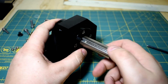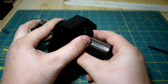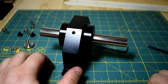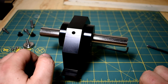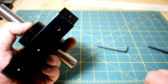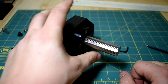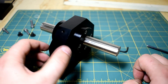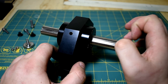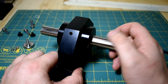I've got everything loosely put together here. I've actually got the flanges a little loose too, because I want them to find their coaxial positions together. The reason I did an oversized bore in the middle with flanges and bushings on the outside is so I can adjust it later. All of the features on the bottom are positive locating features with the frame, and they don't really allow for adjustments unless you shim things. I like doing bearings on flanges because it really lets you move things around. These bushings are also quite thin — less than a diameter long — so you can get a little angular adjustment out of them as well.